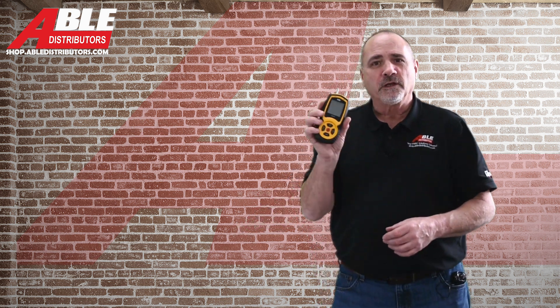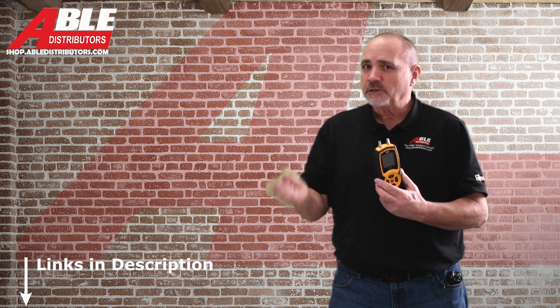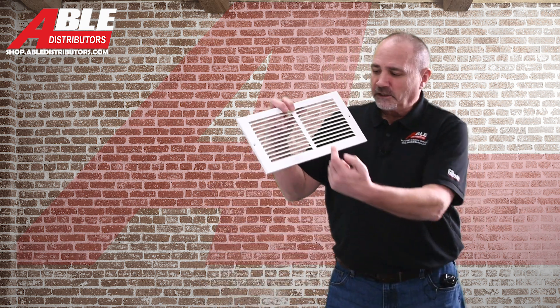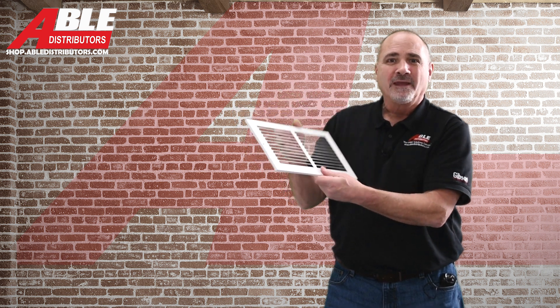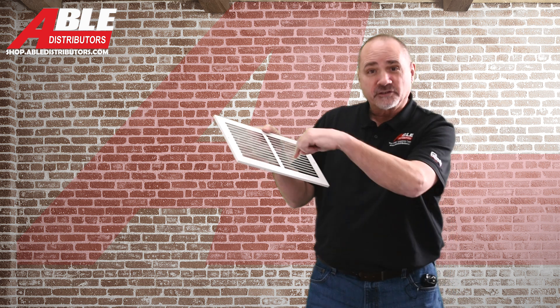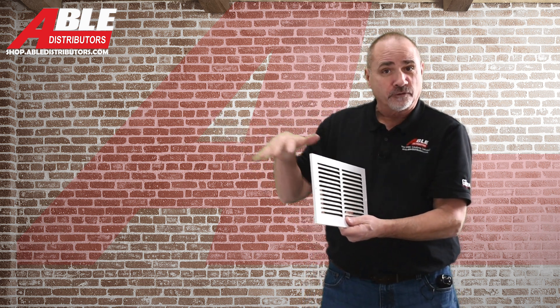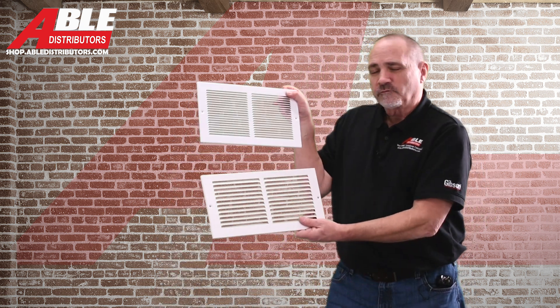I'm also going to link the video I just did on the new UEI manometer — it comes with everything you need to check gas pressure and static pressure and do little tests like this. Now granted, sticking a static probe inside a grill while it's on the wall in a return is not that accurate. I just stuck it in, faced it down, put it on the negative side, turned it on, and saw the difference. It's not scientifically accurate, but from my point of view it did exactly what I wanted — I wanted to know what changing from one spacing to another would do.